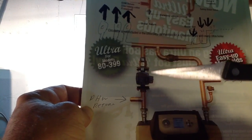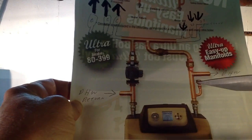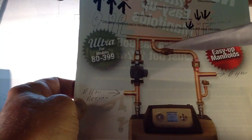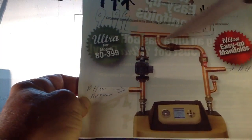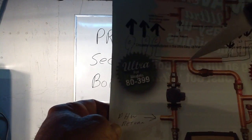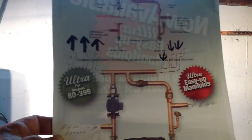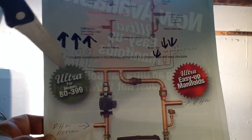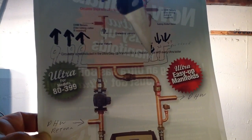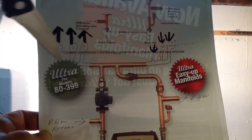The large 0014 circulator comes down right into the boiler, and then the circulation goes back out of the boiler. There's your relief valve, and right back into a check valve. This copper line here is your main boiler water. There are my three circulators for the three zones — there they are added in pen — going up, and then the three return lines from the baseboards coming back. That's your secondary loop.